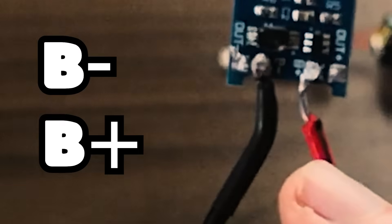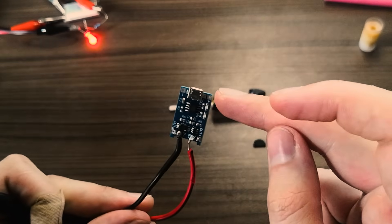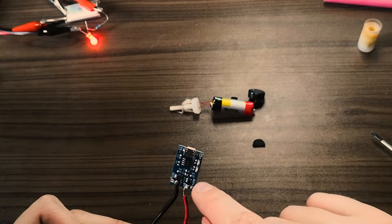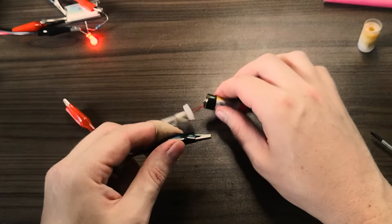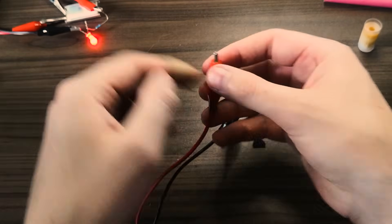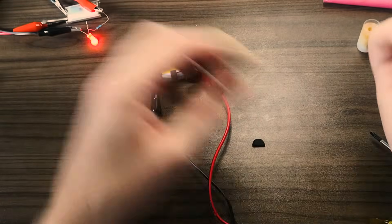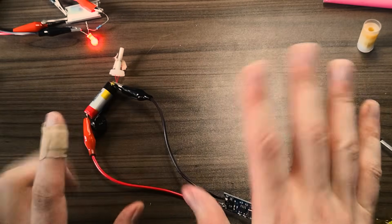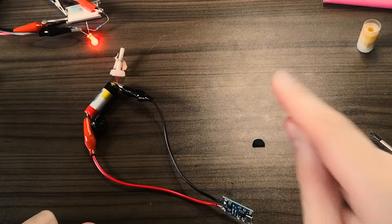The circuit is really nice as it has automatic charge protection. Once this battery gets up to a voltage of about 4.1 volts, it'll shut off the charging circuit to prevent overloading. In order to attach it, it's exactly as simple as it sounds — we attach the negative terminal to the negative terminal and the positive terminal to the positive terminal. Remember to never, ever trust the wire color. You check your terminals on each connection — you don't want to run this thing backwards as it might short out. And a lithium fire is the last thing you want on your hands. On that note, don't put out lithium fires with water — use sand, starve it of oxygen. Don't put water on it; it will only accelerate the reaction.